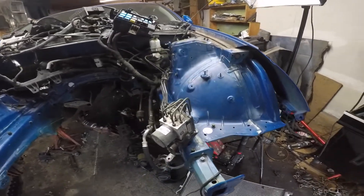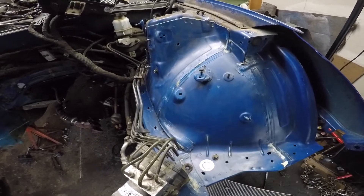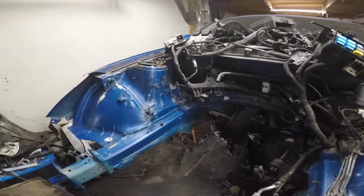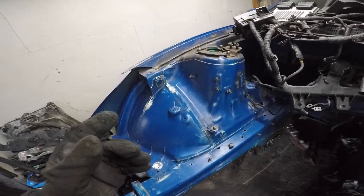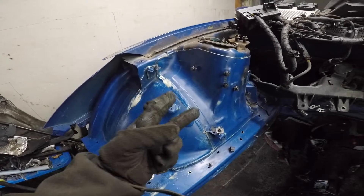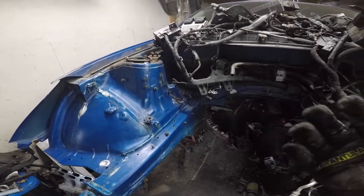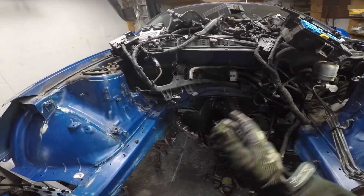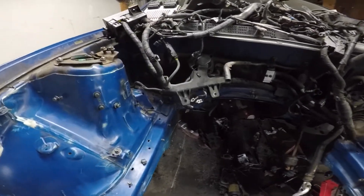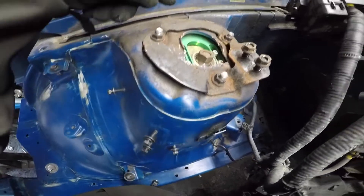This is just after using only the wire brush on the drill. You can see it's much different — night and day difference, it's so much cleaner. I'll go over this with acetone and a rag just to make sure I get off any residual oil. I'd probably do that twice just to make sure. It all depends on how the rag comes out — I use those blue shop rags. If it keeps coming out dirty, I will keep cleaning it.